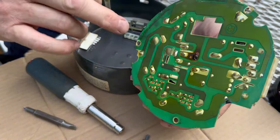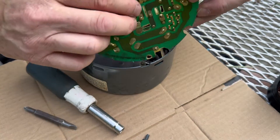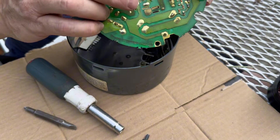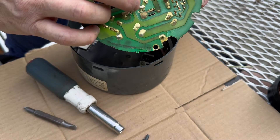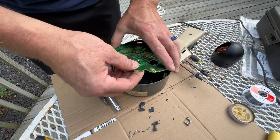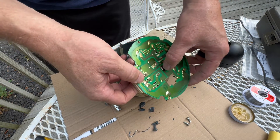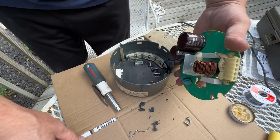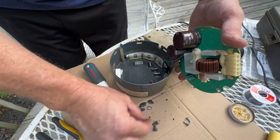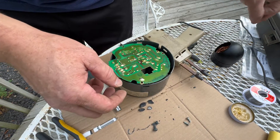Oh yeah, you can see it got hot right there. So I'm going to unsolder that. You can see here — this side here — I'm going to unsolder here and here, and that should come off. I thought I had it unrecorded, but I didn't. So basically I used the Craftsman 200, heated up this joint and this joint, and I was able to pull that out, which ended up shattering the old resistor. So I'm going to get the new one in and I'll show you how to do that.